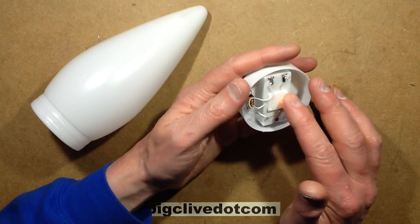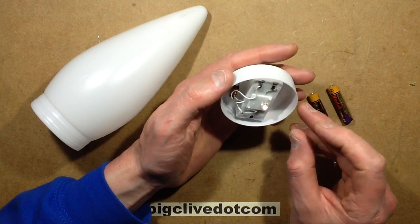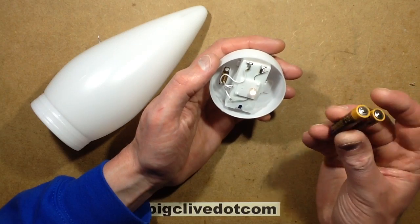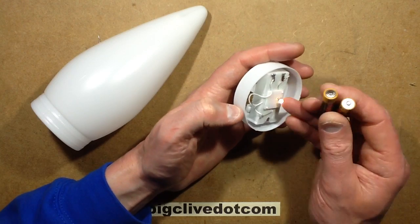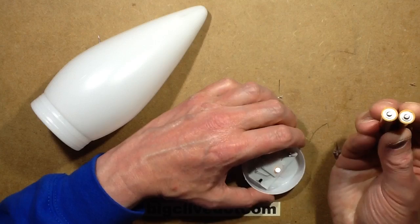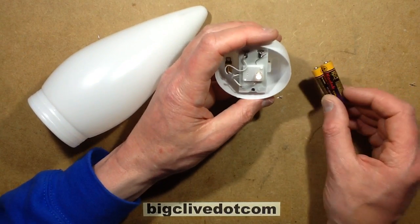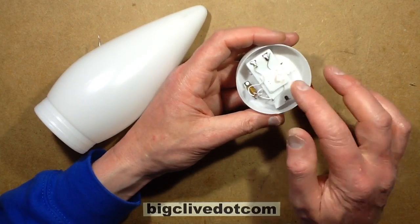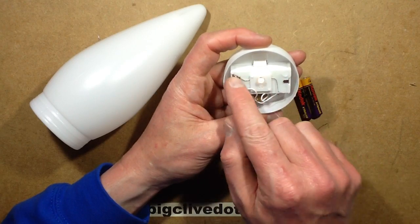The gallium nitride LEDs will probably go out round about 2.5 volts, which isn't going to have made much of an impact on the life of these batteries - they will still last for a long time. But when the LED finally gets too dim and you think you need to change the batteries, keep in mind the batteries will still have plenty of capacity left that you can use for other applications, or even with a joule thief. You could even put a joule thief in here - you'd only need to use one cell.